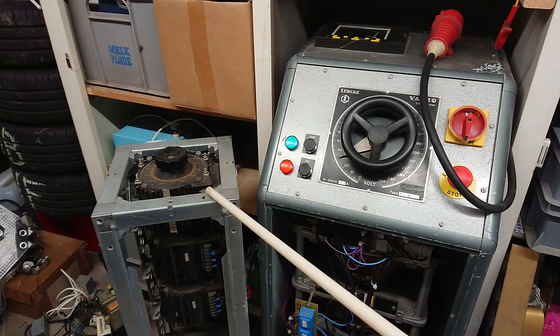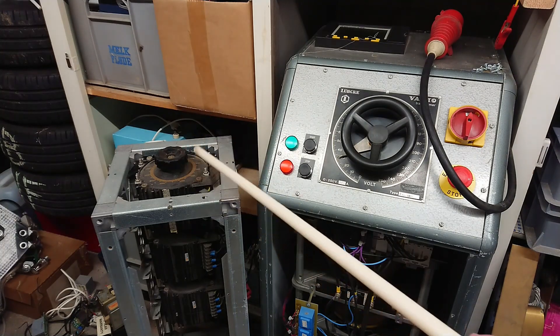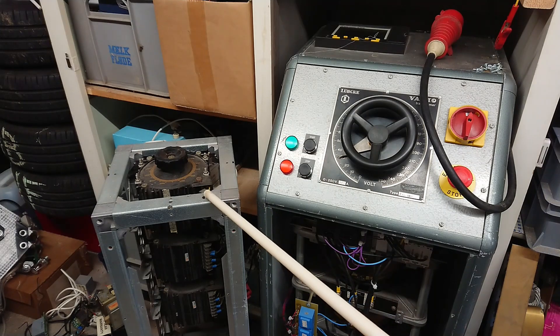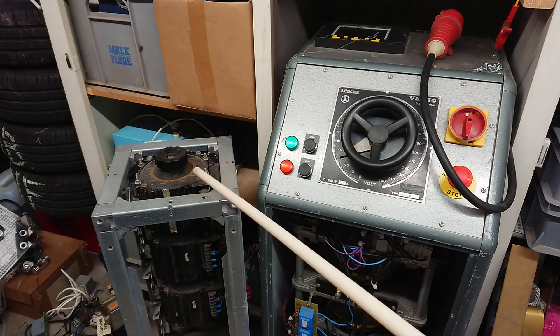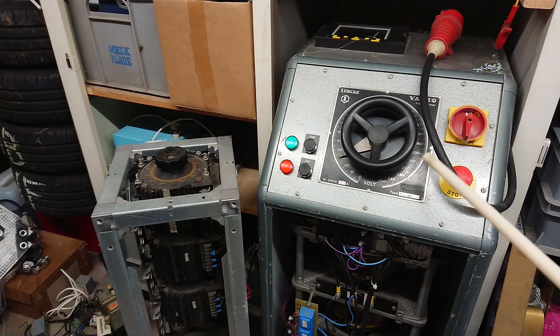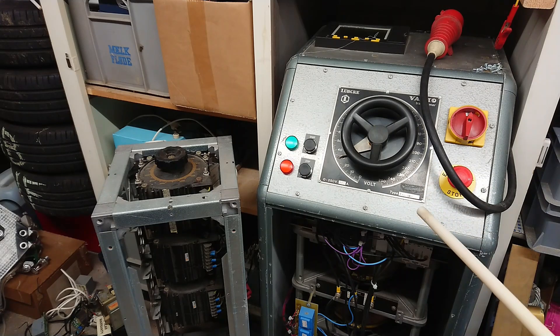Over here we have the 3×6 amp, but it can take a lot more abuse — I actually powered my large dual-resonance solid-state Tesla coil pulling 12 kilowatts through this three-phase variable auto transformer. And this is the big one: 0 to 250 volt AC, 13 amps, three-phase, and that is way over 150 kilograms with the enclosure. So let's take a closer look.